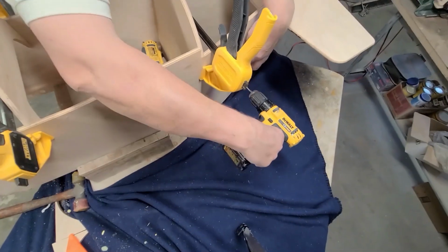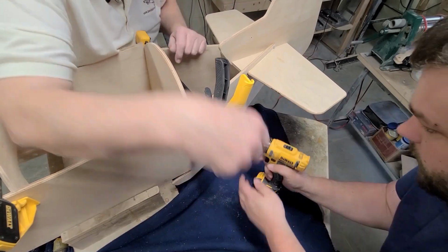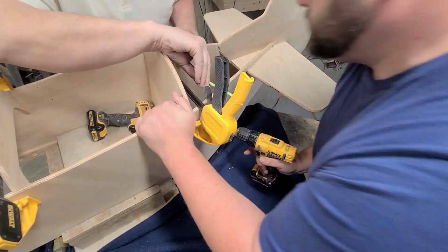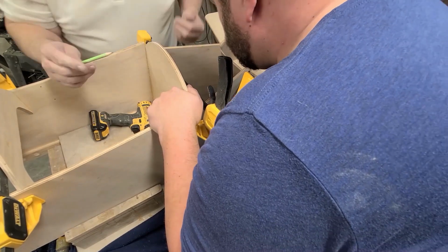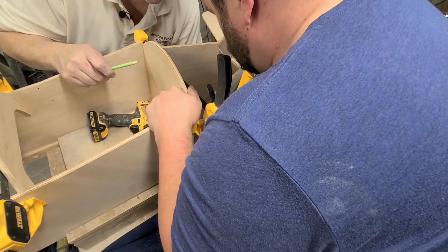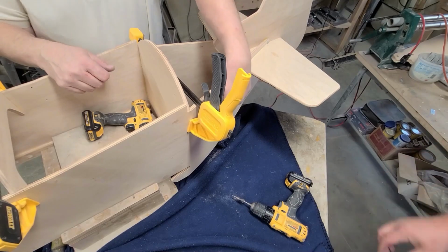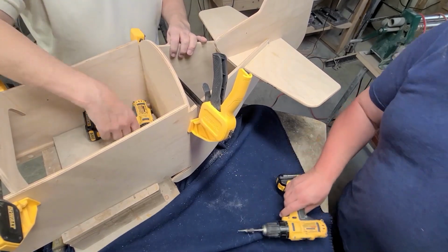Line up that hole with your bit into that hole, but look down here to make sure you're going to hit this other dowel. Get it lined up 90 degrees to the side. Okay. You should hit this. Yep. Okay, go ahead. You got it countersunk? Yep. Okay, so we got this hole done also. Got it countersunk. This screw is in temporarily.